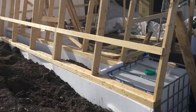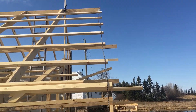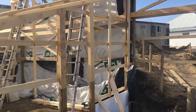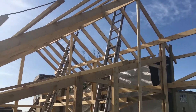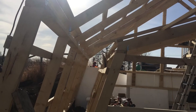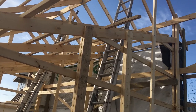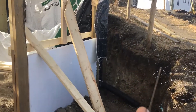I've got some backfilling left to do. There's going to be a wall right even with those purlins — going from the roof to the ground. That will be an independent wall from the inside. So the inside of the greenhouse is one cavity — no joins, no connections — basically two independent structures, which will allow us to roll an insulated blanket down at night and up in the day to gain heat and keep that heat during the night.